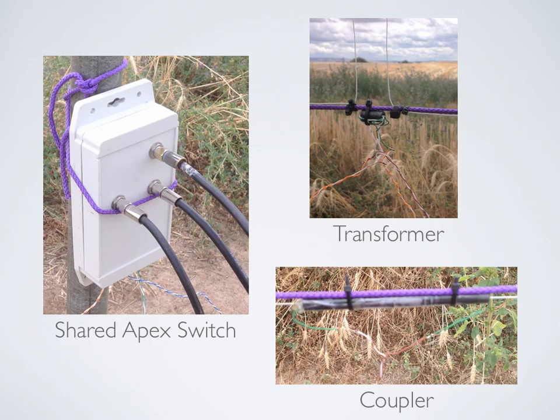Here's a photo of some of the components of the Shared Apex switch — this is just the standard Shared Apex switch from Array Solutions. I also include an isolation transformer in the experiments. The purpose was to improve the front-to-back ratio on 80 meters — we're still investigating exactly why it's necessary, but it definitely improved performance on 80 meters. It's essentially bifilar wound, 400 microhenries per winding. Each loop has a coupler positioned right in the center, and these are one-to-one couplers, though other ratios work fine also.